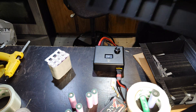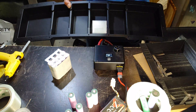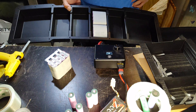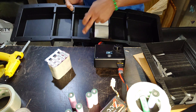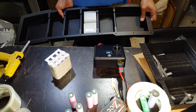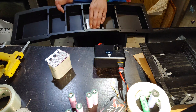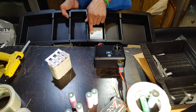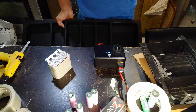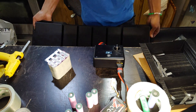It's going to be a flexible battery case — this is actually one I designed right here. What's going to happen is we're going to have one through 12 cells like that. I think it's actually a 12S8P I'm making. I designed it for 12S8P. That's how it's going to fit, and I'm going to have 12-gauge wires connecting all the P-cells. This is not really a how-to video — I just wanted to show you some of the process. This is basically the battery case I designed.